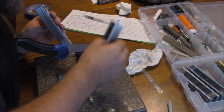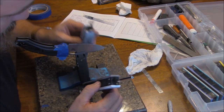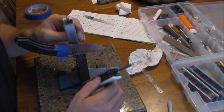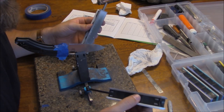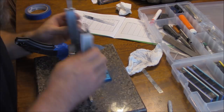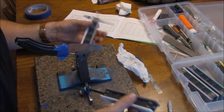These passes are quite a bit quieter than the lower grits. I'll go through and do a bunch of these scrubbing passes, maybe five or six times on each side, then alternate going just one way. I'll work it until I really like the polish and see the scratches disappearing, then flip to the 1600 and do the same thing.